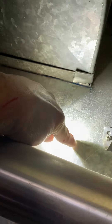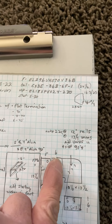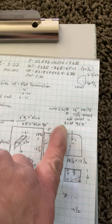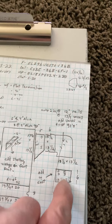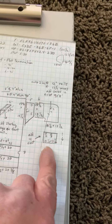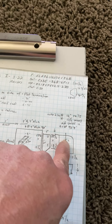Add a 45-degree starting collar just here. I gave you a canvas — we need to cut an inch off each side so it's only six inches in length. These are going to be the same size, so you can use the canvas here or here, whatever works best. Reuse all that duct and add turning vanes in both these 90s — this one and the one down below.